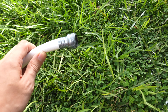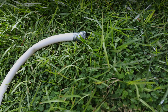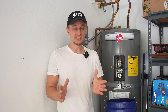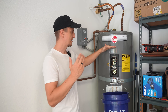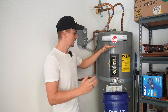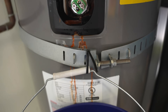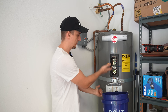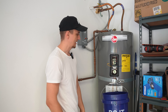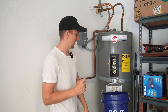At this point I am really tempted to just go ahead and do it on the fly — the water heater is in the garage so it's okay if the floor gets a little wet. It's been about 25 minutes and it's draining so slowly. The water heater probably only drained up to about this level in 25 minutes. I don't want to keep waiting, so I zip-tied a bucket to the bottom, threw a rag on the floor, and I'm going to try to catch as much water as I can as I take this element out. Hopefully it drained past the top element, but most likely not, so when I take the old element out we'll see some water gushing out, and I'll try to shove the new one in as fast as I can.